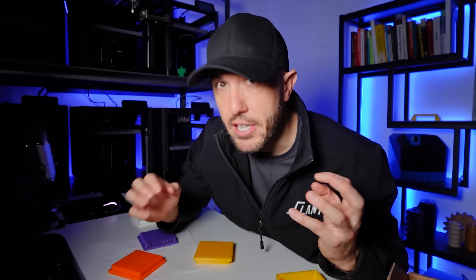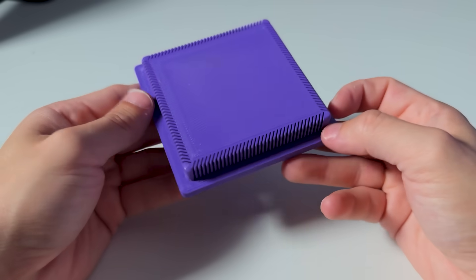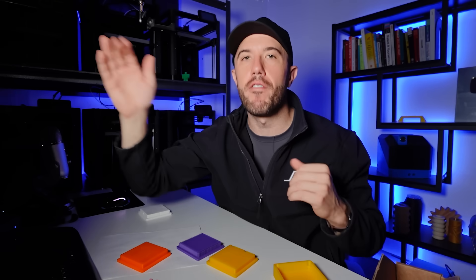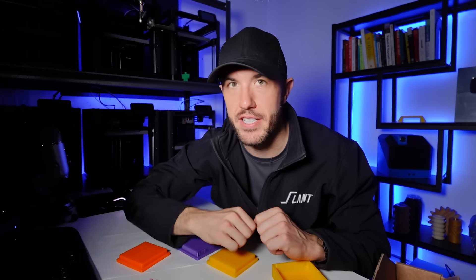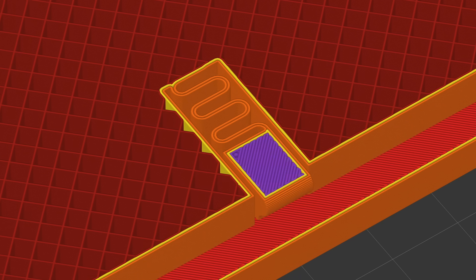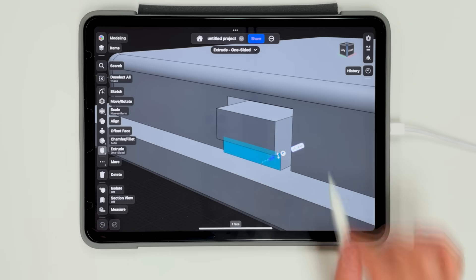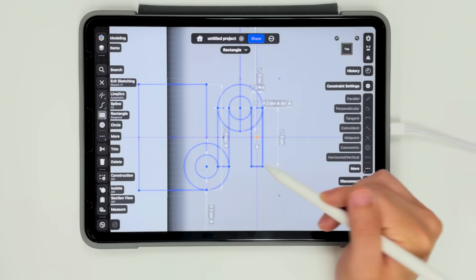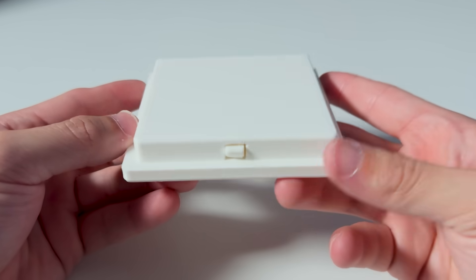3D printing has a superpower in that you can actually make true mechanisms inside of it — something people don't often talk about or understand. While grip fins are a good, universal, and robust way of doing it, sometimes you want even more action, play, and flexibility. The only way that comes is from the part being able to move a great distance, and a fin just isn't enough. This is where internal springs and internal latches designed into the lid come in. Since 3D printing can make really thick parts without causing shrinkage the way injection molding does, you can do all sorts of interesting things. The small latches are the front end, and inside there's a spring that pushes the latch in and out. You have to really tune the design to make sure it's robust; otherwise, bridging above the latch can cause it to jam. But these latches can move much further than a grip fin ever can.